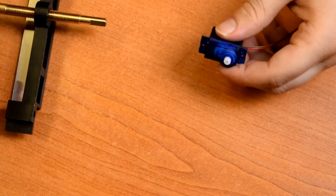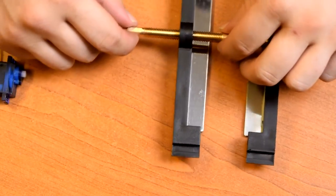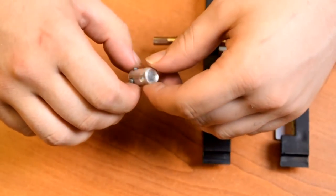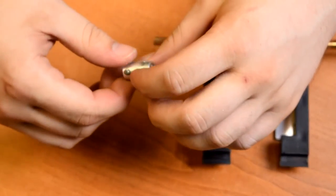So what I've done to join from the servo to this screw part, I've just filed a flat on the end of this and I'm going to use one of these. It's a little shaft coupler. It's about 6 or 7 mil ID. I'll pop a link in the description. I originally had this for a stepper motor, but it looked like it worked perfectly.